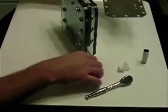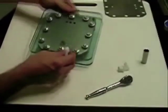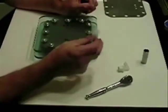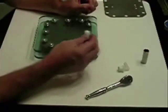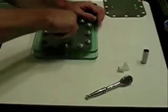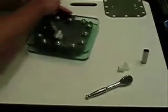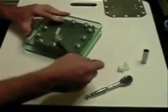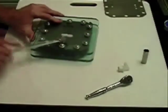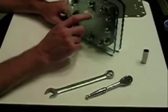I've already taken the liberty of putting Teflon tape on these fittings. These are — I think it's a half-inch fitting — that's what I tapped it out to. They should go on there no problem, line up very well. Once you put the Teflon tape on there, there's nothing like a trusty Craftsman 5/8 wrench. Bend the top and the gas will come out — this is the end that will go out to your bubbler.